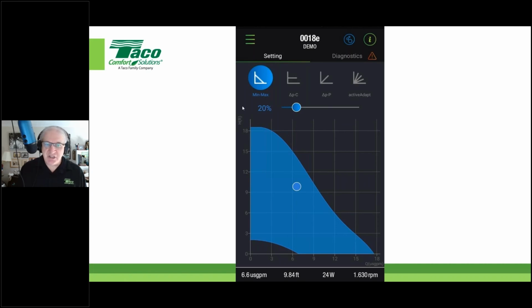And as you slide this down, let's say we want to get it down to that minimum setting, like say you were using it with the 0.33 and the hot link plus valve, you wanted to get down to 0.33 GPM. What you do is you just take that and go all the way down. And then that's the minimum setting. More importantly, though, let's say you wanted to make sure you were at 1.6 gallons per minute for a recirc setup. Well, what you would do is you'd slide that blue dot back and forth